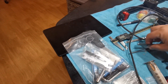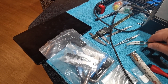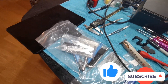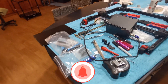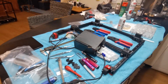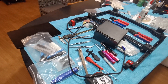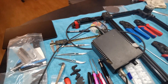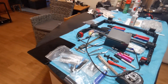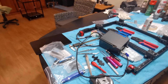These little spring-loaded tweezers are really good — you can just grab little things. So that's pretty much the basics. Once you've got all that stuff you'll pretty much have a hassle-free, tool-wise, assembly process for putting any sort of printing system together. You definitely need all these crimping things because you might want to shorten your wiring up. You also want some little picks for flicking the little clips out on the JSTs and stuff like that — for flicking the pins out and reorganizing the wiring if it's in the wrong ports. So anyway, this is just a little prequel to the build. I'll probably put this in at 1.1 or 1.2.